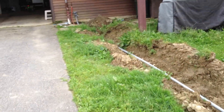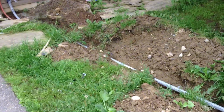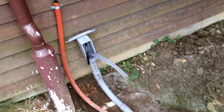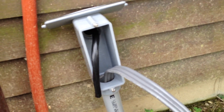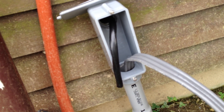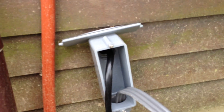Up at the house I have a junction box I put in. So I'll have the 8-3 Romex UF coming right to this junction, and then from inside this garage I have the 8-3 Romex non-UF, just an inside version, that I'll be splicing together right here and then running into the garage.